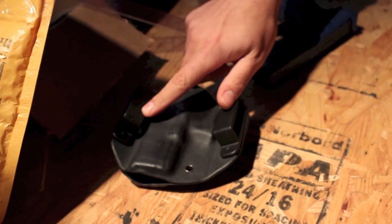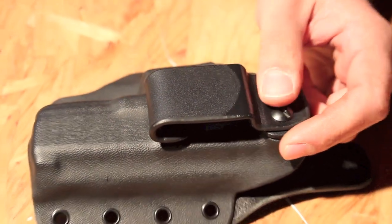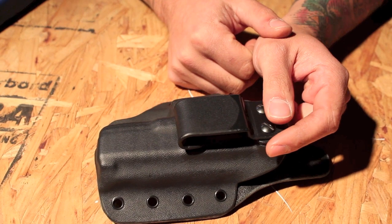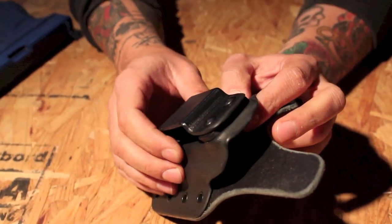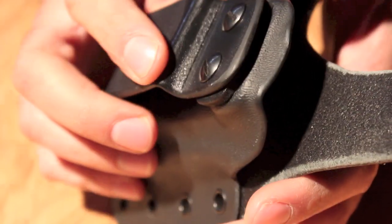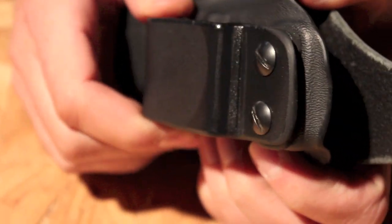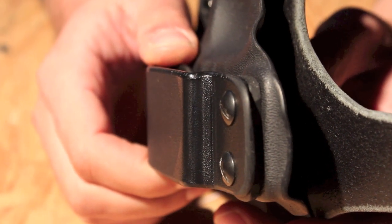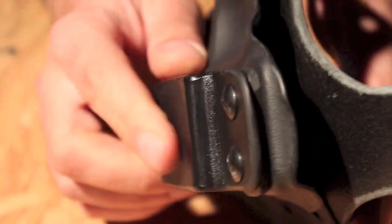On this item you've got yourself some injection molded loops — very good idea. I would recommend the IWB clip designed by our friend Tony over at Multi Holsters, who's having them produced and sold through Index Fasteners. That's a good solution for what you're trying to do here, so you don't wind up with this clip where the finish is kind of interesting — there's a deep bevel around the edge, over-glossing and overheating, and a crease down the middle of the fold. Kydex J-hooks always break. Ask anybody who's been making holsters for a year or two — they will have stopped using Kydex J-hooks. They break with a disturbing rate of frequency. Get yourself an injection-molded component for this.